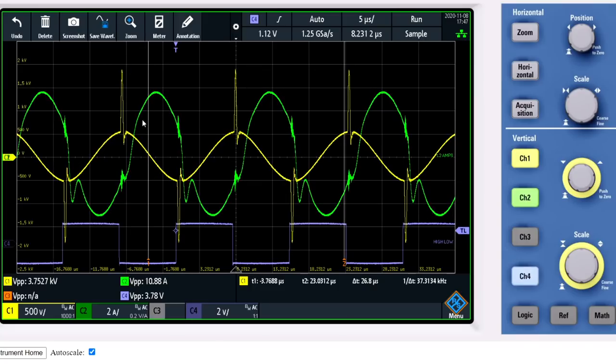And these impulses are not charging up the capacitor anymore, although they will be a little bit. But I would expect if the impulse is riding on top that the energy is wasted and we would not have this large amplitude. This amplified amplitude of L2 is rather strange because we don't have all the energy of the impulse that is absorbed in L2 anymore, but still it grows in voltage. So there is an amplification.